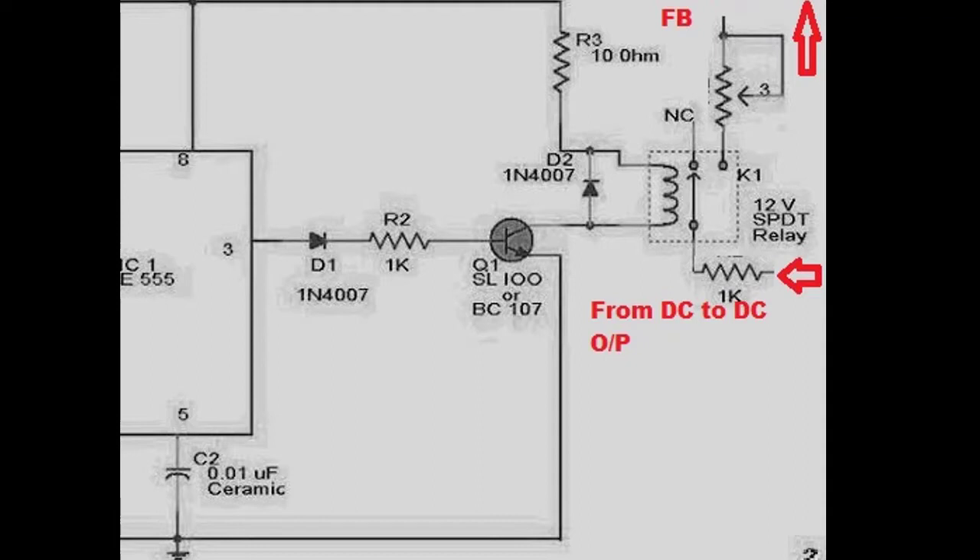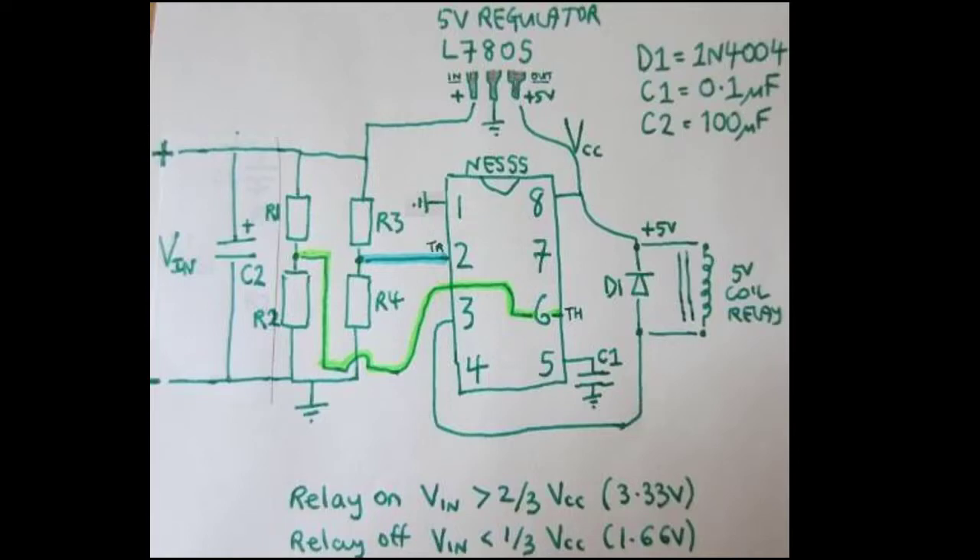There is no need to give direct feedback to that pin — if you give the input to the preset pin, it will take it. So this is our external control circuit, which is a comparator made up of a 555 IC, which is easily available at very low cost. This is a voltage divider network which will compare the solar input voltage.